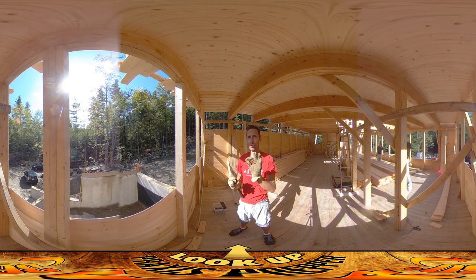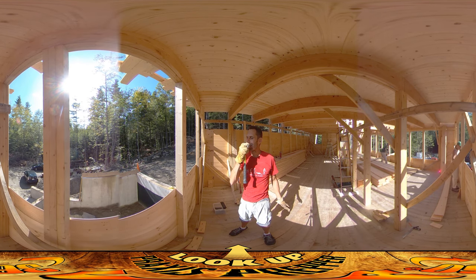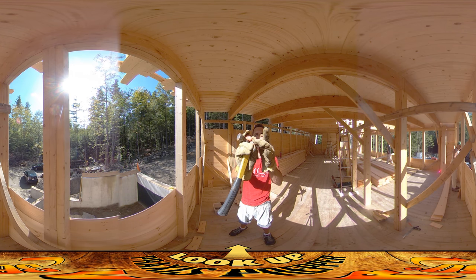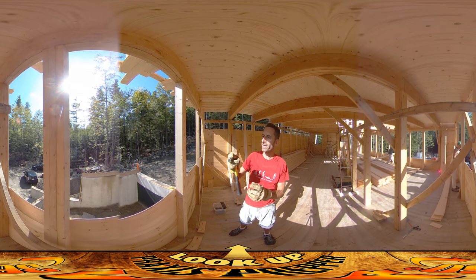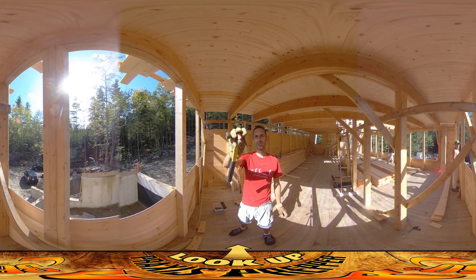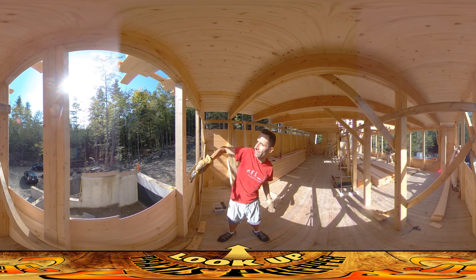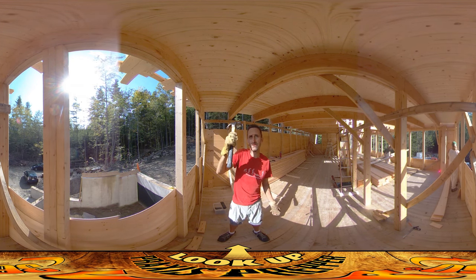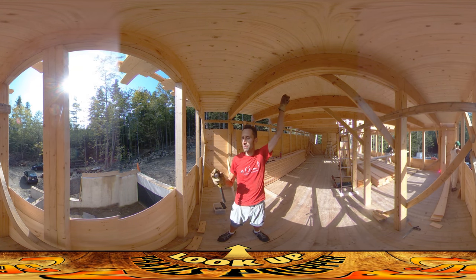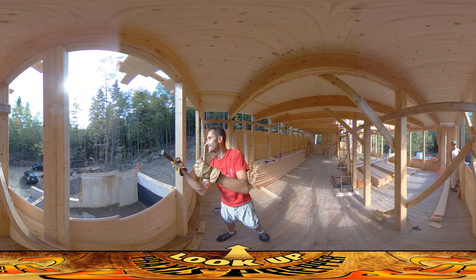You can take the nail — maybe it's in your mouth. I know these are galvanized nails, so technically I'm putting poison in my mouth right now, but you've got to break some eggs. You get it so that the head side is right up flat against the hammer face, and then with one hand you can get it started and tap it in with the other hand. So if you're hanging on, you can get it going and then hammer it the rest of the way.